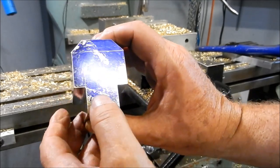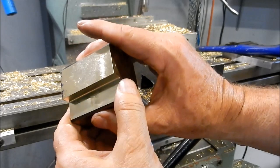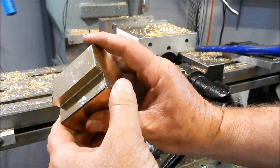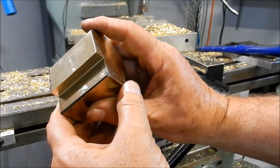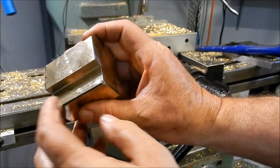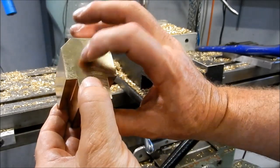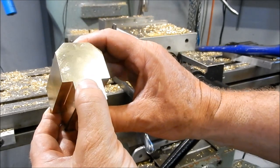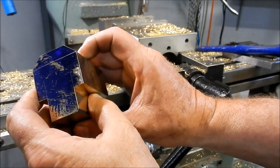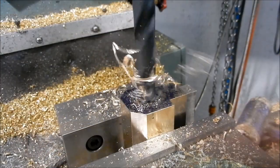All right, well, that's our nut brought to final shape. I'm happy with that. As I said, we've not quite cleaned up down there, which isn't going to hurt us because it's not a working part of the nut. And we do have to take a bit of relief out here, so it's going to be a lesson to look further again. All right, well, we'll set up. We'll get this bore done, hole drilled and bored, ready to set up in a lathe to do our final bore and start cutting our thread.